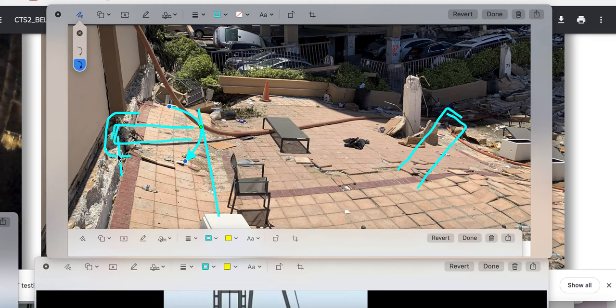And this is where we get our rotation and our drop down. As it does that, it grabs the rebar — the reinforcement — because it's interlocked. And it rips it down. And that's where you get the spalling of rebar down. Rotate it like this — rotate it — you see it, like hooks out of the wall all the way down.